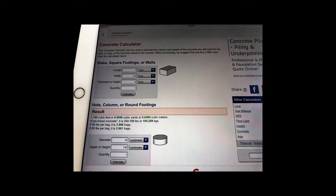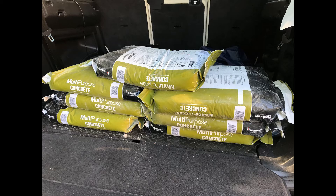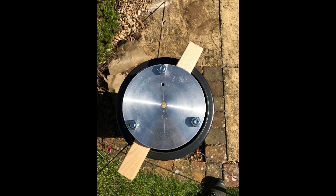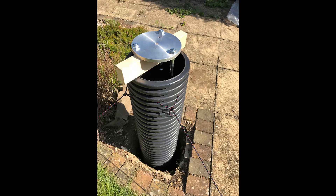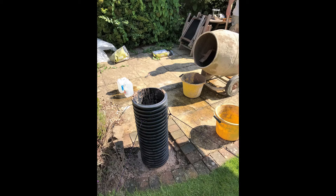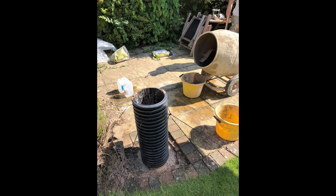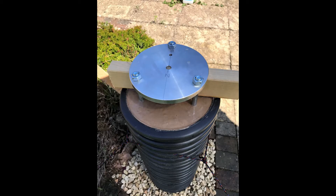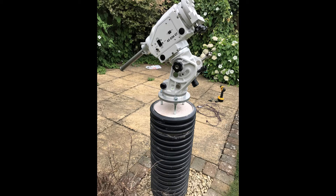Used online calculators to work out how much cement and concrete I would need — turned out to be seven bags. Support the tube, make sure it's upright. The bit of wood gives me some space to get my hand underneath to tighten up. Found some mates with a cement mixer, filled the hole first, then the center, keep going till you get to the top. Put the mount head adapter plate in and sink the bolts right down. They all set quite nicely, and it was marked with north so I could set the alignment for Polaris permanently later on.